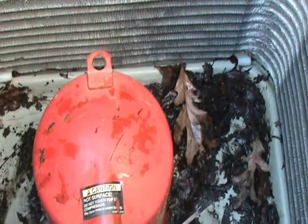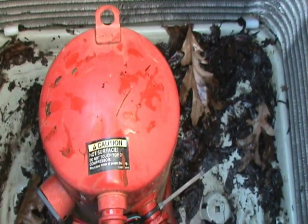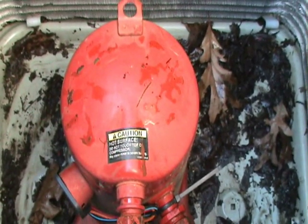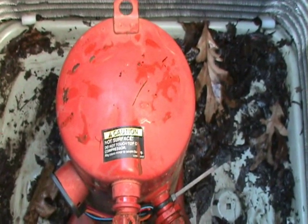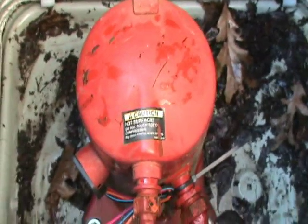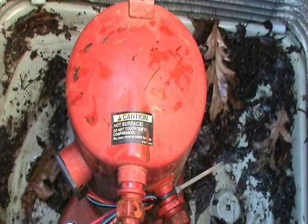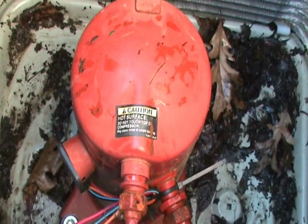The most efficient type now is the variable speed, variable frequency type compressor, sometimes called inverter types. If you believe you're having a problem with the compressor and you've narrowed it down in your troubleshooting, the first place to start is to remove the top of the condensing unit and gain access to the compressor. You'll notice on the side there is a terminal box — take that cover off and there will be three wires and three connections. Make sure those connections are not damaged, burned, or anything like that.